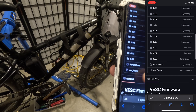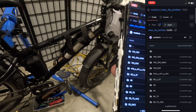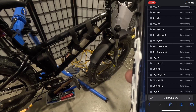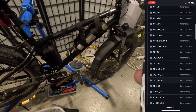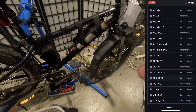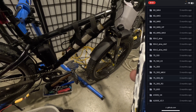What I read on the internet is you have to go into this VESC firmware archive. I went to 6.05 because that's the latest VESC firmware I'm trying to get onto my Flipski. I came down and found 75100 V2 — that's the one we want for the Flipski 75100 Pro V2 controller. There are some other ones listed too, but I'm just using the Flipski 75100 Pro V2, so that's the one I went into.